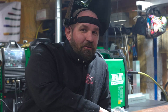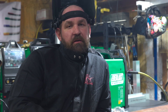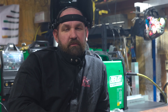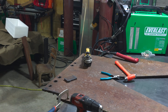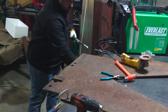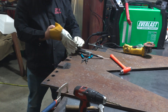Now that we've shown this machine is actually underrated a little on that 5/16ths pierce rating — we just did a half inch — we only rate this machine at a 5/8 severance. So I want to cut a little square out of here, weld it to itself, and see if we can push it to one inch. We're going to cut some more plate, weld it to itself, and see if we can get that one inch severance cut. I'm running the same machine — still on the Storm 215C — switching my plasma leads over to the MIG side, welding up this half inch plate to itself real quick, then switching the leads back over to plasma. Maybe three or four minutes real time, and now we're going to try to do this severance cut on one inch thick material.